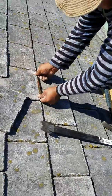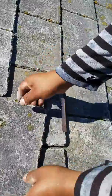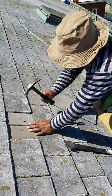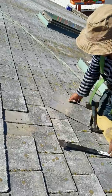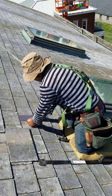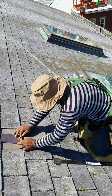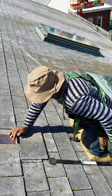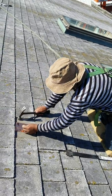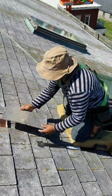As he puts the new piece, you've previously nailed off the copper bib, which now will hold it in place. You take it out, you get the copper bib, and he's re-securing. What Milton will now do is take a new bib — that little trick he's doing is getting the reveal, so that he knows exactly where to put the placement. Getting a pre-bend to the copper. Fastening it off.